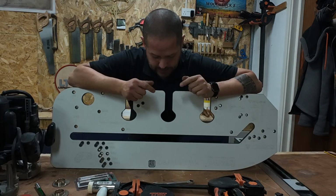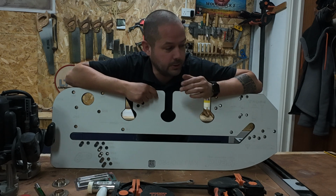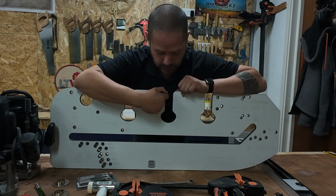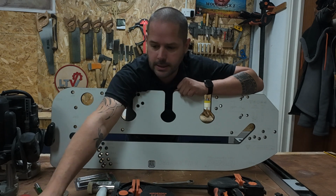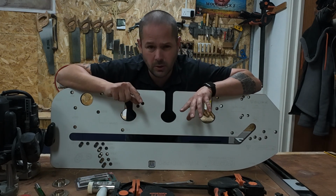Okay, so next on our list of tools is going to be our worktop jig. Now this is just as important as the skill saw and the router and everything else, because this is what's going to give us our dog leg to do that. It's also going to give us our bolt holes, which you're going to put your worktop connecting bolts in, but I'll come back to these in a moment. So yeah, this really is the thing that's going to make everything look really good.